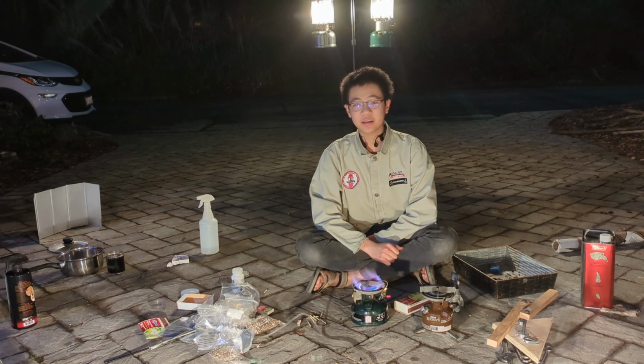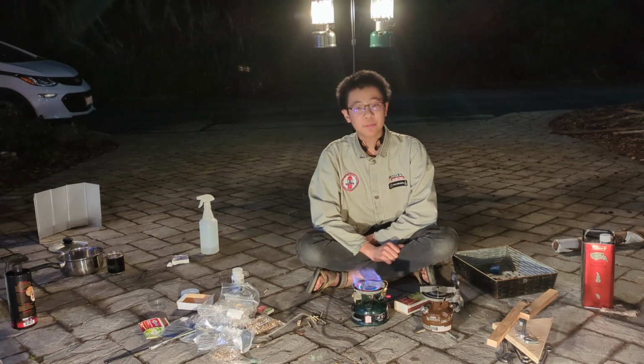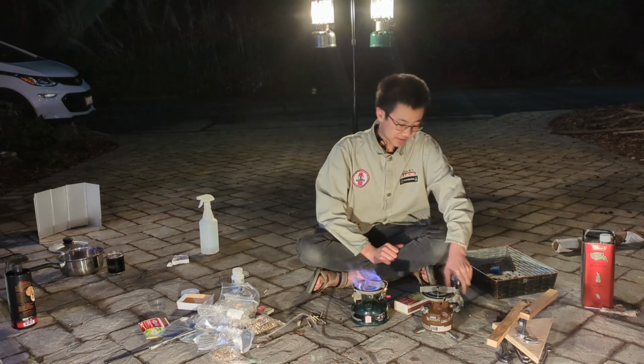Compare that to a Teflon packing. With a Teflon packing, you simply loosen the packing nut, you wait about half an hour for the packing to relax, and it's relatively easy to pull the entire thing out. Now, another advantage to my part over Coleman's part is this.